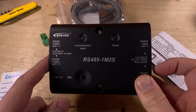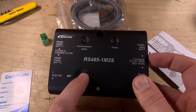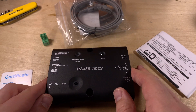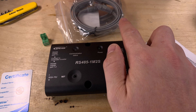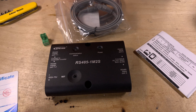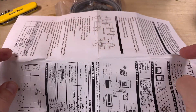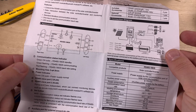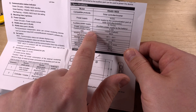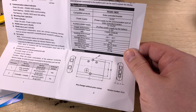There is a small set button that changes the communication speed. The default baud rate is 115200 and it can be changed down to 9600 — useful if you have a large network or lots of interference. Everything out of the box comes at the same speed, so this probably won't be needed. You also get two flat RJ45 cables, a certificate of authenticity, and a basic one-page manual.